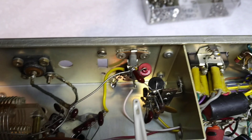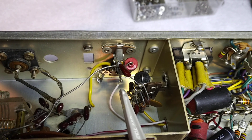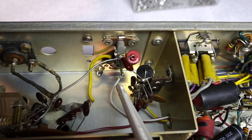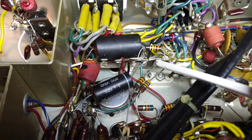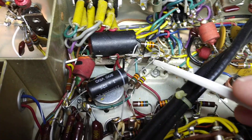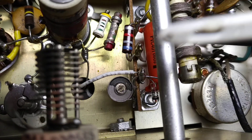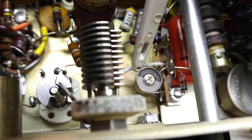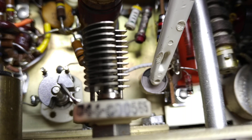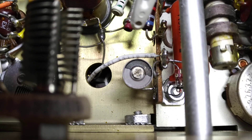When you have a space condition, this line is open if you're using a traditional teletype keyboard. Or, if you're using an op-amp or TTL driver, you would put a negative voltage on there — RS-232, like a negative 12 or something. But in the case it's open, your negative bias is going to come from the high-valued resistor dividers anyway, so you're still going to get minus 10 when it's open. Or you can supply minus 10 or minus 12 externally. Under those conditions, this diode is reverse biased, and because of the RF choke, from an RF point of view this point is now open, which means you now have the gimmick capacitance in series with the trimmer capacitor. So you have less capacitance shunting this VFO line, and that means a higher frequency.